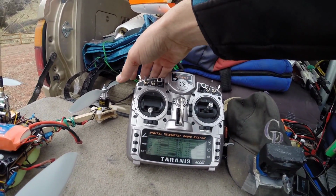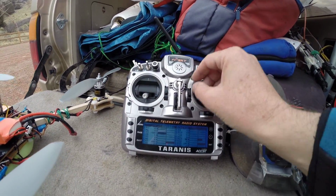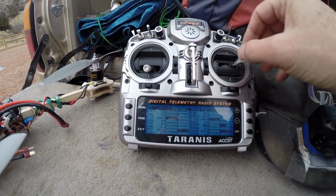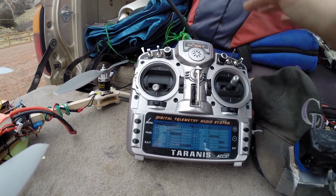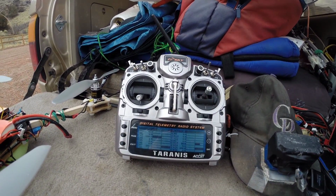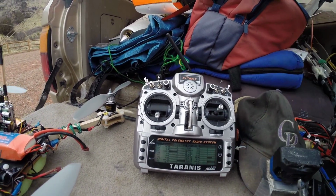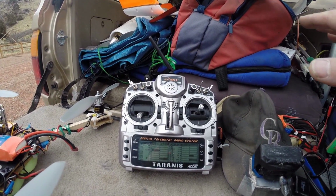And when I flip on flight mode 2, when I flip this switch, I get full control. So there's the channels 1 through 8 moving. When I flip it over to relay, the relay is under full control. When I flip the switch, no matter what mode I'm in, to FPV, the relay goes center stick on everything, which happens to be GPS and position hold, neutral throttle, which means just to hang where it's at. So basically, when I flip that switch, the relay stops wherever it's at.